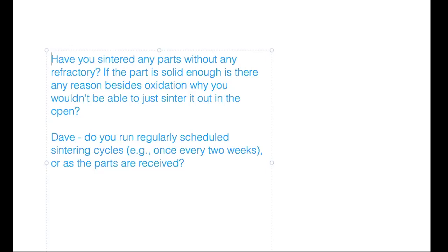On sintering schedule: they do customer work as parts are received, while also constantly doing their own development work. Even though they feel really good about cycles established for bronze, copper, and stainless steel, they're always looking to optimize. They're always running the kilns. The kilns have good programmable controllers with delay timer capability, so sometimes Dave will delay a cycle so he or his partner Joe can be there for phase two. They basically set the kilns, leave, and come back to see what they got.